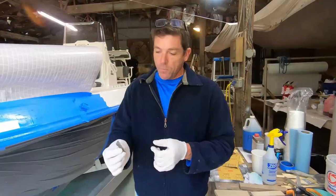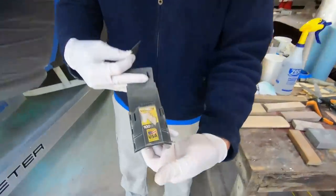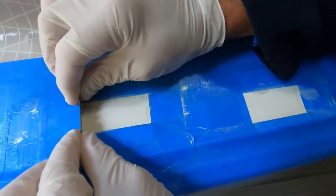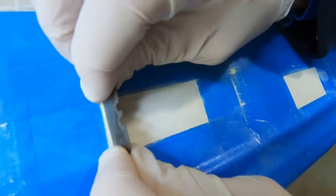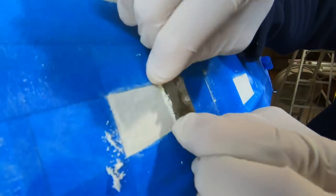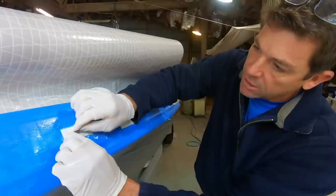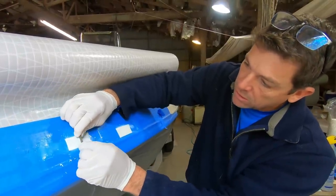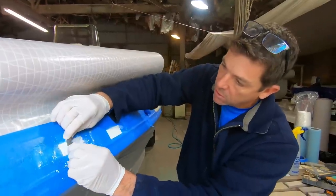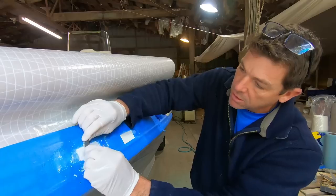I've got several other videos on the channel where we just use a standard straight razor blade — what you'd buy at any home convenience store. You're holding it flat and you can draw some of the material off the top, making little shavings. I would highly encourage doing this: we put this gel coat on last night and we're shaving it off today. Gel coat is going to get harder and harder the longer it cures, so if you can get after it sooner the better.